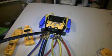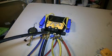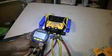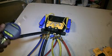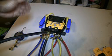I really haven't had anything to compare it with initially, because when I first started in this trade, or started doing service calls, I had this blue vac here. And initially, I had so many problems with this blue vac, not so much the gauge itself, but I was also using my Appion hoses, and I really couldn't get this gauge to work. I had to pretty much take the Appion hoses off and go back to using my regular refrigerant hoses and using the built-in Micron gauge.